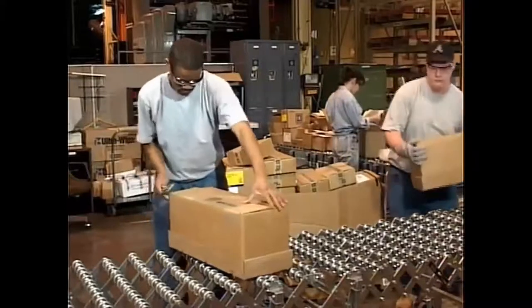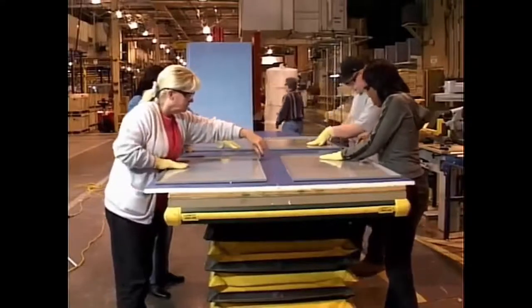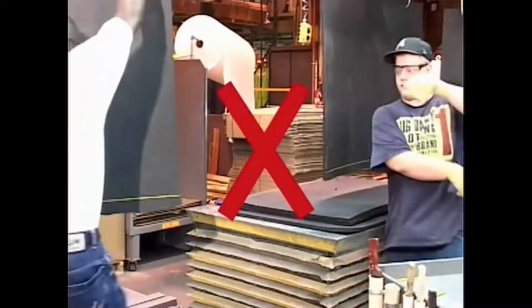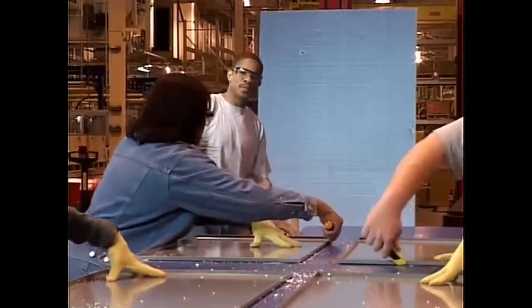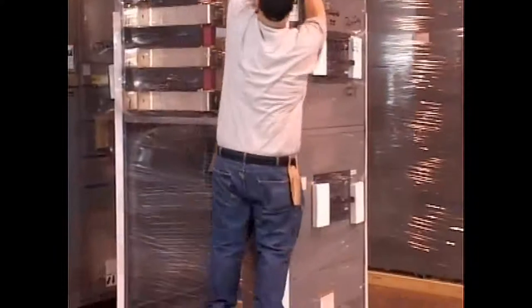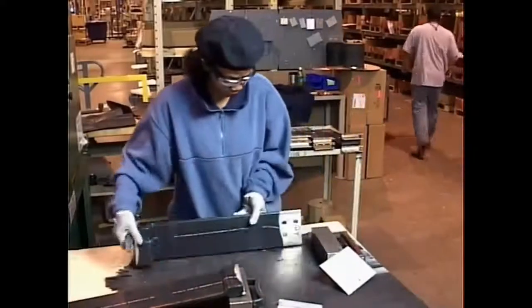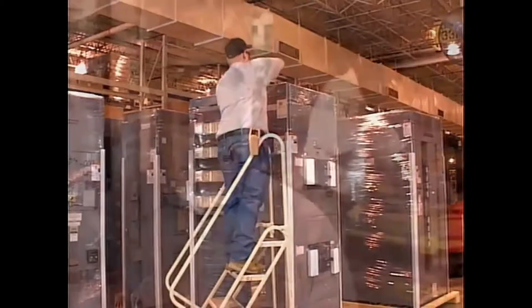When using knives, keep in mind that co-workers may inadvertently enter the path of blade travel. Under ideal conditions, co-workers should stay at least an arm's length away from an exposed blade. However, in many applications, this is simply not possible. When using a knife in close proximity to others, it is critical to keep the blade under control. Avoid making large sweeping cuts which may send your blade toward a co-worker. When approaching a worker using a knife, make sure they're aware of your presence before entering the cutting area. Never attempt to cut an object when either you or the object is unstable. Where possible, place objects on a flat, stable surface before cutting. At least make sure you have a stable stance and a clear path for blade travel before cutting.